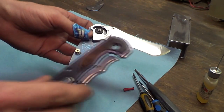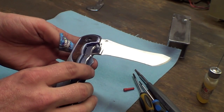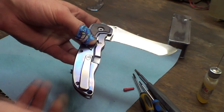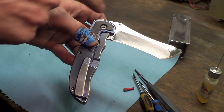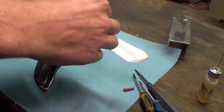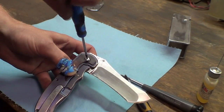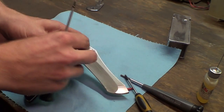and then this I do with the blade halfway open so that I can rest the lock bar just kind of on the detent track as I put it together. And then I just squeeze so it all clicks onto both the spacers, because they have little shoulders on them, and the pivot pin. And then just get that pivot in. Whoops. Throwing stuff. Alright.